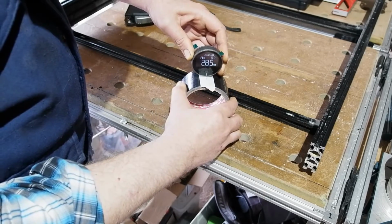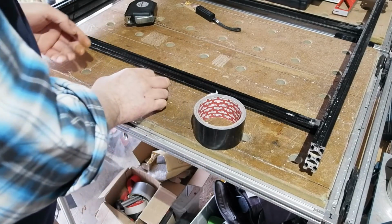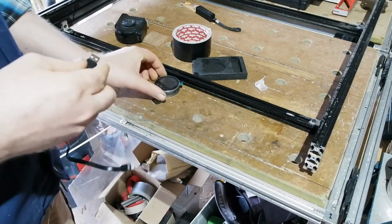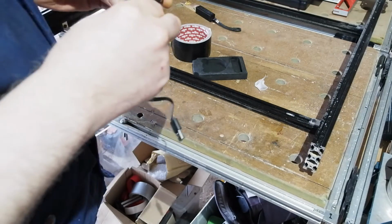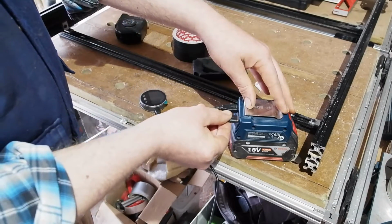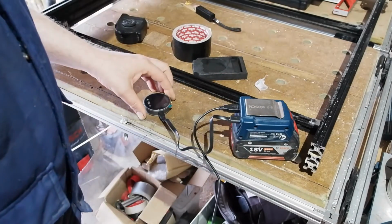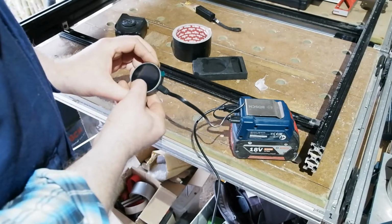I've done some other tests on this and it does appear bang on accurate. It's calibrated just fine. The problem appears to be how it's used. By this I mean it doesn't matter how accurate it's calibrated if, in using the tool, slight wobbles are registered, wheel slips occur losing a mil or two, or if meeting a wall or edge, if you've leant the tool off a perfect centre axis, it can't help but give you the wrong measurement.